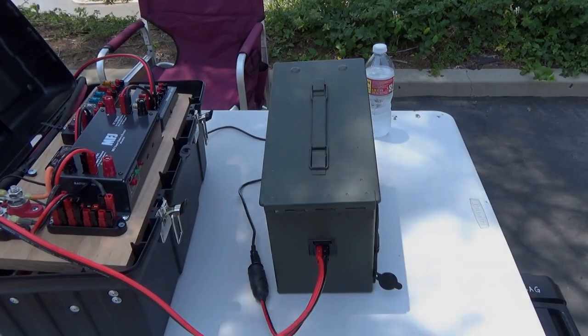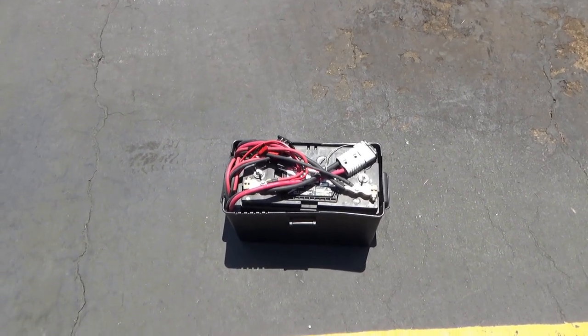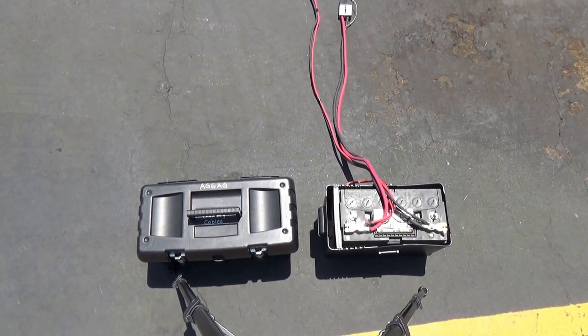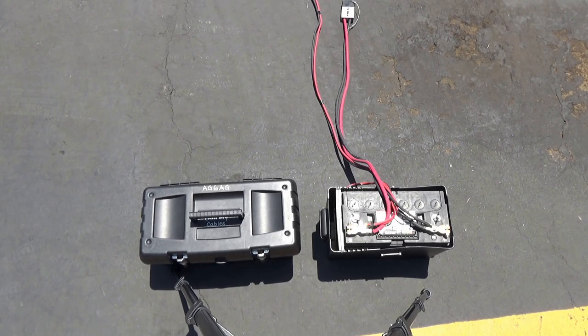What do you do past this? How about going to a bigger battery? More power! This will get me through all sorts of issues as far as time. I could actually run the station I'm showing here for a good 12 to 16 hours without recharge if needed. Now, that's not based on 100% utilization or 50-watt output, but it is based on normal run time for a net control or a remote rest-stop location.